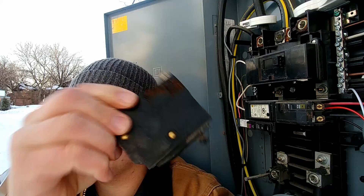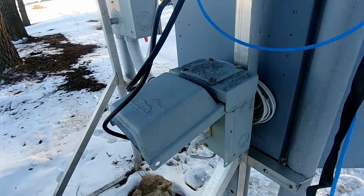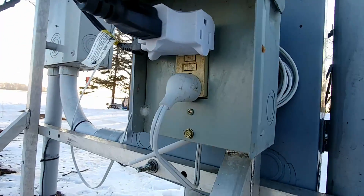Hey, my name is Ben. Thanks for stopping by. Today I want to show you how to go from a standard breaker like the one I'm holding here — 20 amp breakers, what we're looking at today — to using a ground fault breaker in order to get rid of having to use point-of-use ground fault outlets like this one right here that went bad on me.